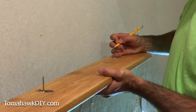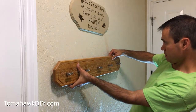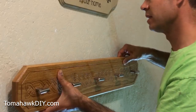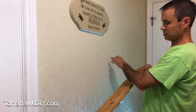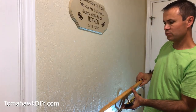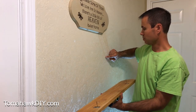I'm going to take and put some graphite on the tip with my pencil — probably also use a little bit of paint or something. I should have my level here. I'm going to double check it, but right now I'm just eyeballing it, then apply some pressure that will put the graphite as well as a little indentation. So I've got a point here, and this one is actually about three-quarters of an inch below where I marked. Let's check my level and apply some pressure. Now I've got my two marks for my screws right here and right here.